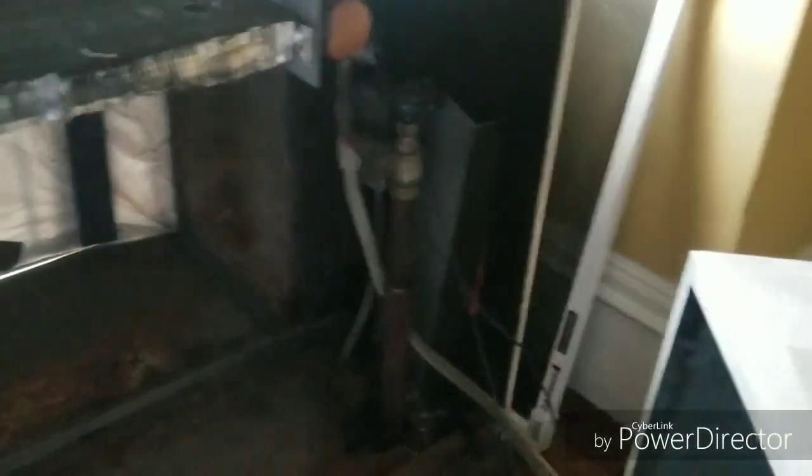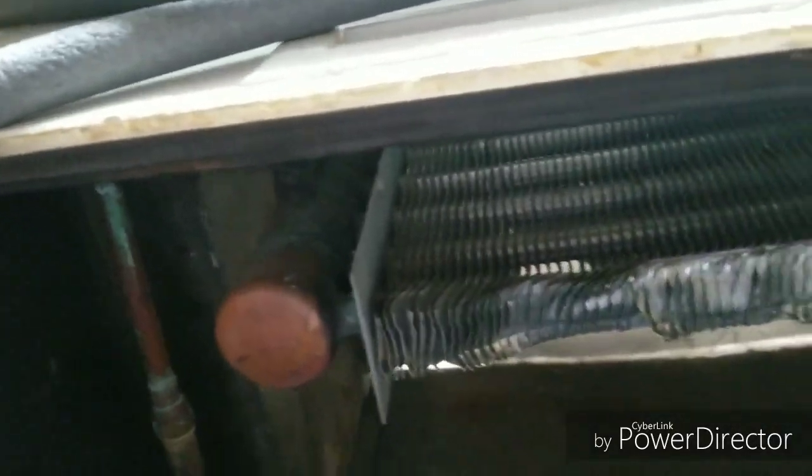Here it is, the last unit — another Island Air. Got my piece in here. This is the valve. This one's tight because the unit pushes up against this valve handle and that trap. Then you push this guy back in and you insulate around the side so no air can come through. There's a steam coil. Typically in these PTAC installations, you have a steam coil or a hot water coil up here, and your PTAC slides in the chassis. Your aquastat usually is on the return line because it likes to get the full coil hot before it turns the fan on — it's like an efficiency thing.